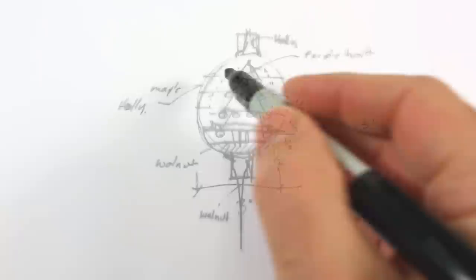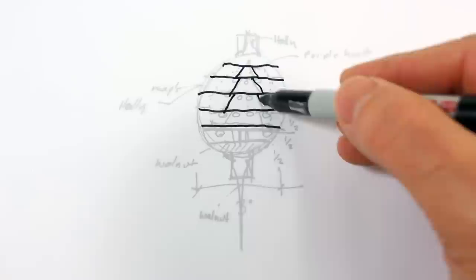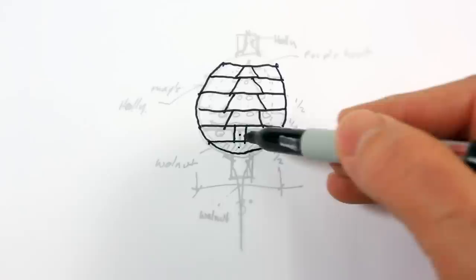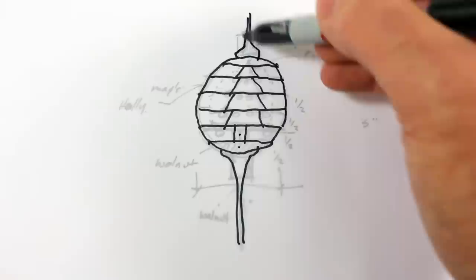In building this, I'm going to make it in layers. I'll make four tree layers, made of a piece of purple heart in the center flanked by a piece of holly on each side — that makes the body of the tree. Under the tree I'll make a trunk, which is a piece of brown wood flanked by holly on each side, then a piece of ground of that same brown wood, and then a decorative piece at the bottom. At the top, I'll use a piece of holly to be a bit of sky above the tree, with another decorative piece of holly above.